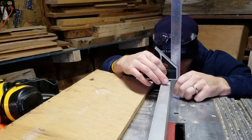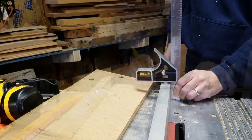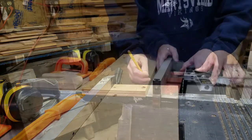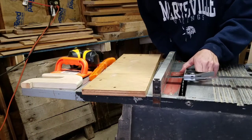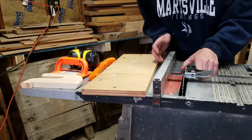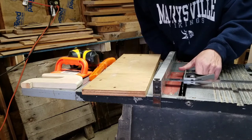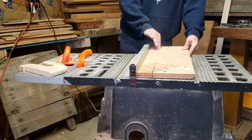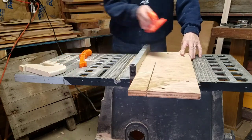To build this jig you want to build a box around your fence that slides along it. Here I'm getting the gauge of how tall these pieces need to be. One thing to keep in mind: I'm using the depth gauge and I did not take into account the width of the blade. So I will be cutting these a little short, and later on I do go off camera and recut these. Keep that in mind — you do use a depth gauge, but take into account the width of your blade.